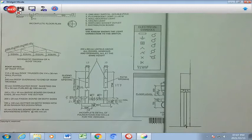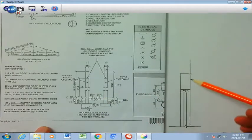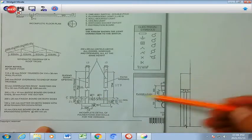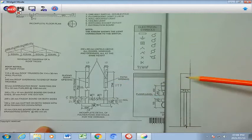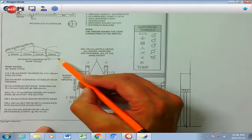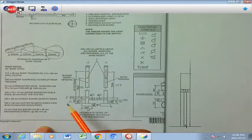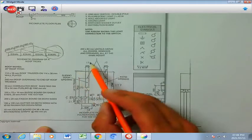This video is specifically targeted at the roof structure, and I want to work through it very slowly so that you can see how the roof actually unfolds. It is very important to read the information, interpret it, and convert that information into the drawing. At the moment, our existing part is the wall, which is now 2740 divided. What's going to happen next is that you're only going to see this part of your roof, and you must keep in mind that that piece tells you that the roof is going to go like that.